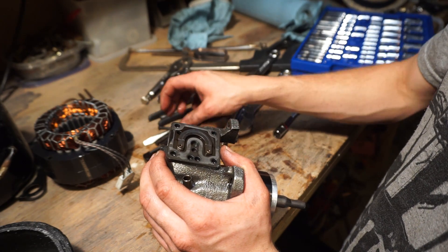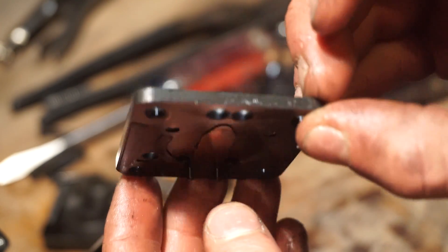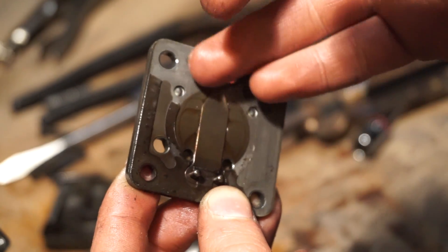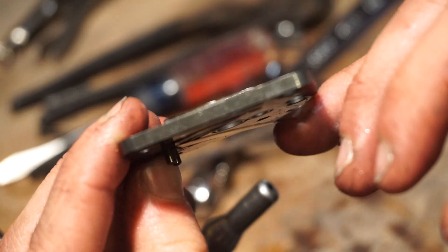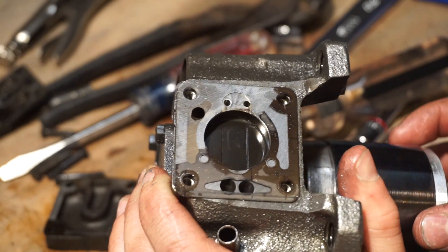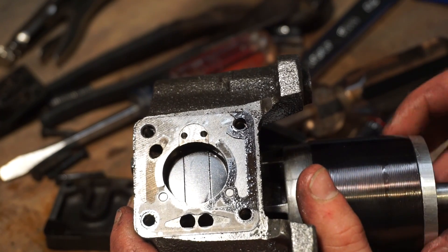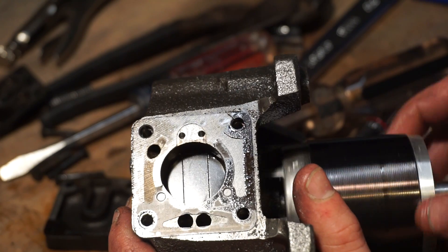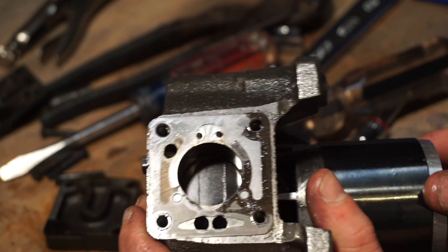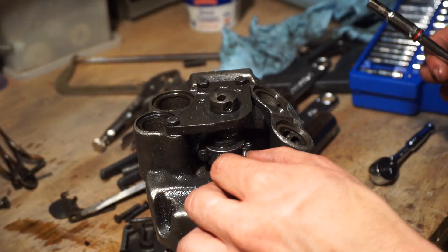So there's the head off. This is the head, or the check valves. This is the intake check valve. When the piston is coming down — because this is where the piston is right here — when the piston is going down, it creates a vacuum, opens this check valve, which lets gas in. And then the piston goes up and opens this little check valve underneath there — there's a little reed valve. Looks like it's got about three-quarter inch travel, and it's about a one-inch diameter piston. I think that's perfectly usable, honestly. We're going to have to somehow fit a spark plug on there. We're going to need to put some holes in it for ports, which will be quite fun.